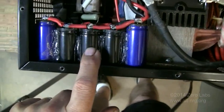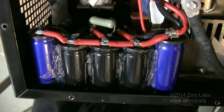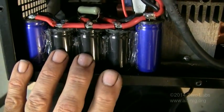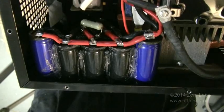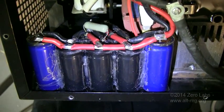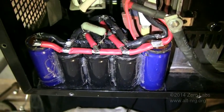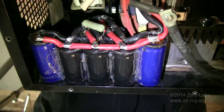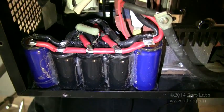These capacitors are salvaged from UPSs that I took apart. These are good, very high quality capacitors with very low ESR — equivalent series resistance — meaning they can circulate a lot of current without heating up. That's very important when selecting capacitors, and it's always better to use a bunch of smaller capacitors than two or three large ones. I have a total of eight capacitors for close to 60,000 microfarads — about 7,000 microfarads each at a working voltage of anywhere between 50 and 63 volts.